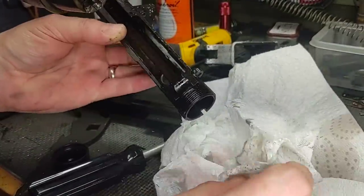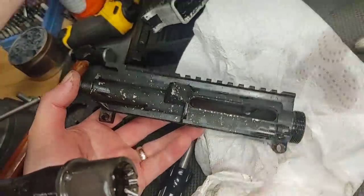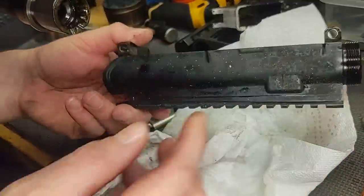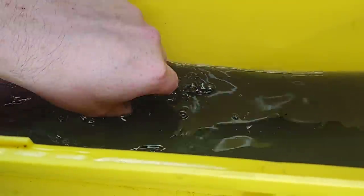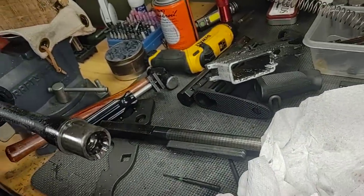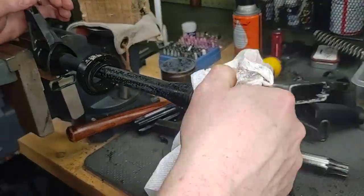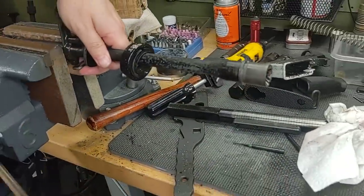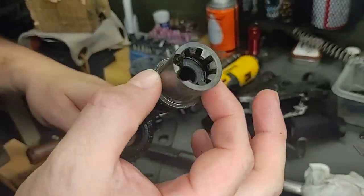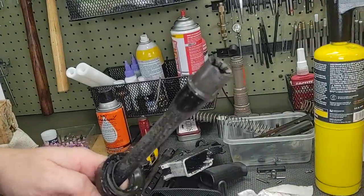What I'm wondering is if something changed significantly in the opening here. Nothing's cracked right now. If you look at the back of my bench, I do have the appropriate pin gauges that I'll need to check if something is the proper size. What could have happened — we can use the micrometer here after we get this thing soaking — is something happened with the barrel extension. Maybe it warped and it's not quite round anymore, so we can take multiple coordinates with the micrometer once it soaks.